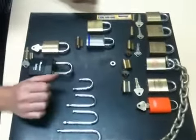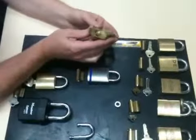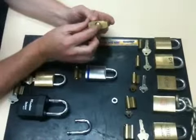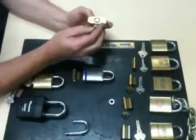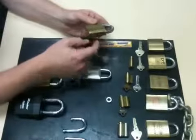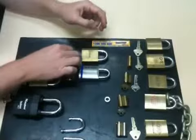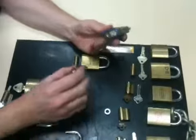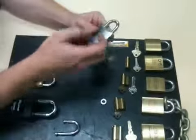Just looking at some other brands now. With Bi-Lock, it went through a similar evolution as Lockwood, with the original 234-style plug being inserted into the padlock and then a retaining pin being attached to the side. The new generation of Bi-Lock padlocks now takes a figure eight style housing to give it more flexibility.